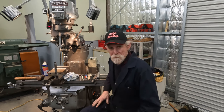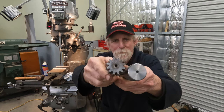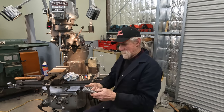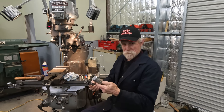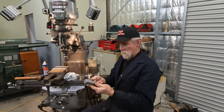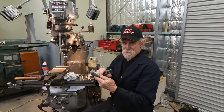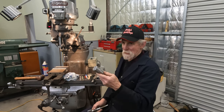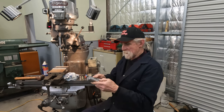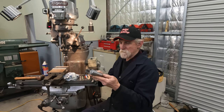Well, I suppose we better bring this one to a close here. So I need to go and order a cutter so we can cut our teeth. The shaft came out very well. Very happy with the material selection. So when we harden after we've cut the teeth, the hardness on this will come up a bit, but it's not going to be glass hard or anything stupid like that. So if it comes up around the 45-50,